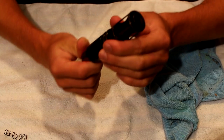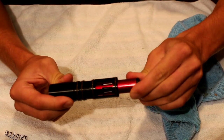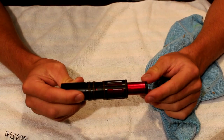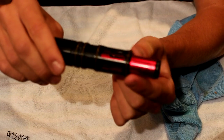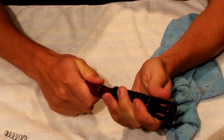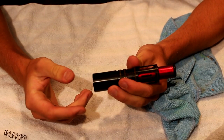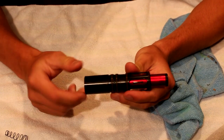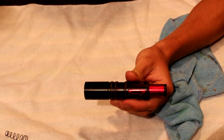The reason is that you can't pull it out this way, okay? There's no way you can pull it out that way because there's a little milled groove. But there's this little rubber soft tip, or soft part of the bolt, right here. If you try, you can push it through and literally yank this thing all the way through if you'd like. But I don't do that because there are inner O-rings and stuff. And as you can see, it's sort of a struggle to yank it through, because it grabs on all the inner O-rings as you rip it out.